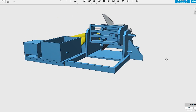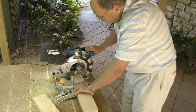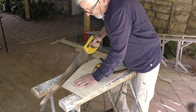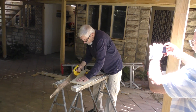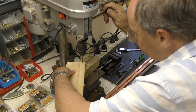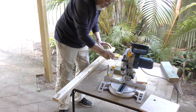There is only so much you can do in CAD, so we decided to build a full-scale mock-up of the launcher from scrap pieces of wood. We wanted to see how it would operate as well as getting a sense of the scale when loading and unloading the rocket off the launch pad. Doing the mock-up also helps us look at clearances for different parts of the rocket that might not be immediately obvious from the CAD model.